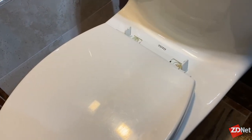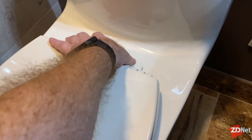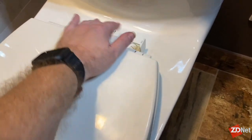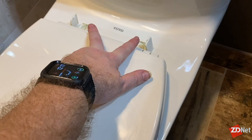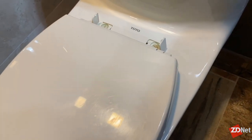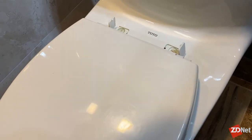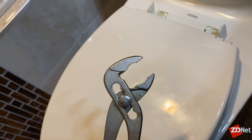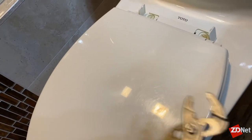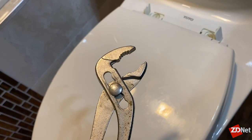The next thing we're going to do is remove the toilet seat. Most toilet seats have these tabs which you're going to need to pop open, as I've done already. You've got two bolts here, and underneath these two bolts are nuts. You're going to use the screwdriver to loosen the bolts, and the nuts you're going to remove with your wrench. You might want to have somebody help you because someone's going to need to hold it underneath to provide tension, and the other person uses the screwdriver. That's why I have my wife Rachel here to help me.